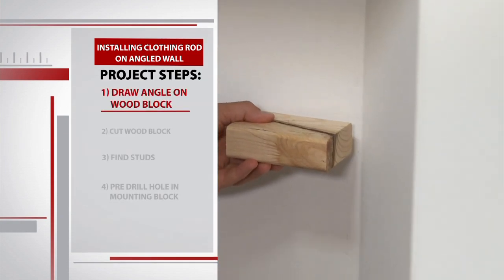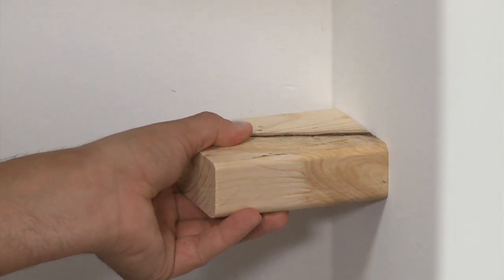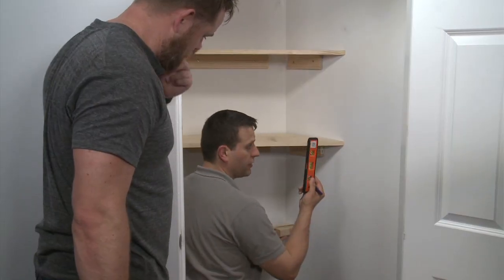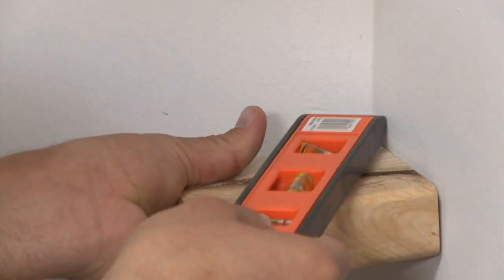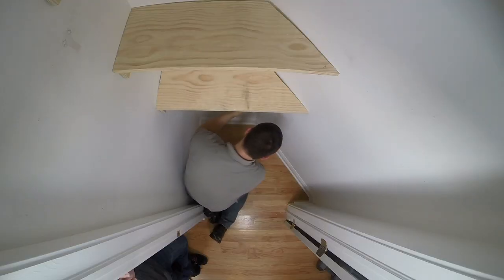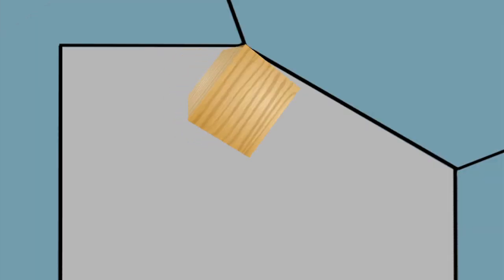Take your block of wood and place it straight onto the straight wall, then rotate it over to the angled wall. Take a tool that has two flat surfaces at 90 degrees — in this case, a level. Put the flat side of the level against the back wall and make a line along the torpedo level that makes a 90-degree turn with the back wall. Because we need two parallel surfaces to mount our rod, we need to cut our wood block on an angle. So place the block on the back wall, tilt it to the angled wall, and draw a vertical line from the corner out.